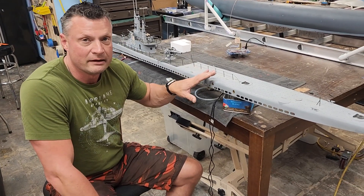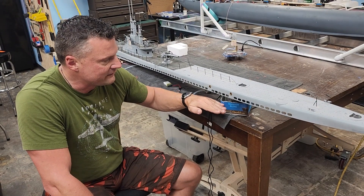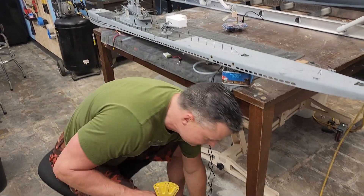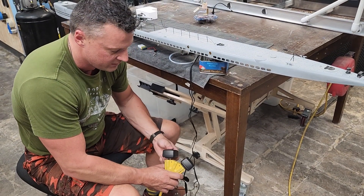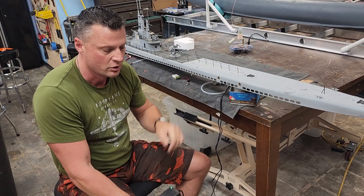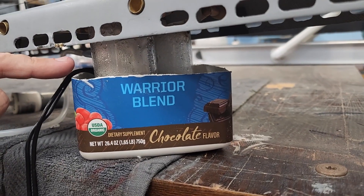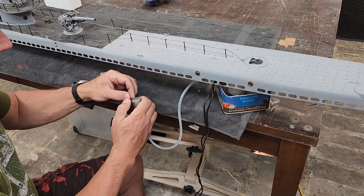We've got the simulator all rigged up here — a little container of water where the water level is roughly where the boat is supposed to float in surface trim, simulating what this system will have access to at the correct level. I'm going to plug both of these in now. We're going to have these battery operated and on a float switch, so when the model submerges the units will turn off. Right now if you look real close inside you can see it's all full of vapor — water droplets and a really thick vapor making it completely opaque in there. I'm going to power up the little air pump and let's see what happens.